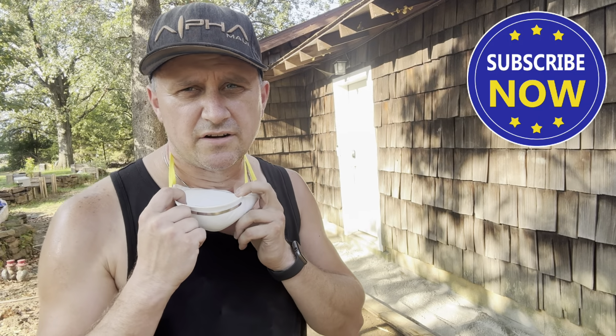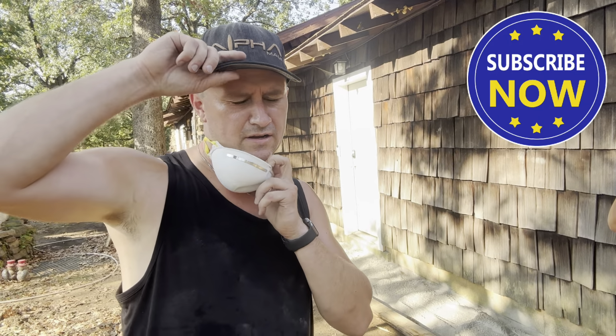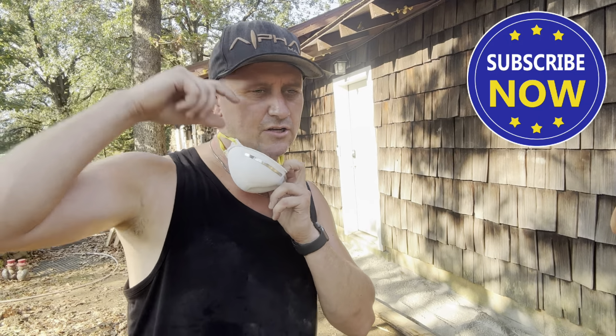What's going on, guys? We're at day 2 of doing the continuation of this. We didn't start till later in the day. It doesn't take that long to do it. It's honestly just getting the concrete and laying it down. So we're doing about a 12-foot by another 5-foot section this time. That's about as long as you can go, I think. We'll see how it screeds. It might even be a bit too long, but we'll give it a shot anyways.